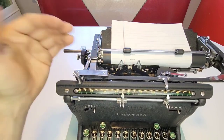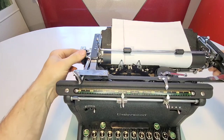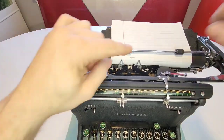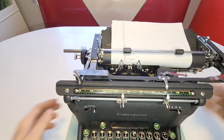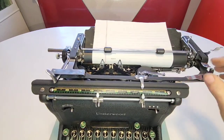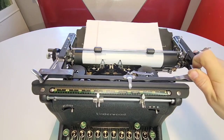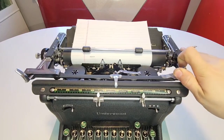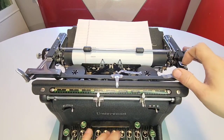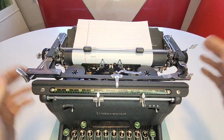If that spacing isn't what you want, there's a clutch on the side — pull it out and the platen is now free to move. So if you're doing a form that has different boxes, you can slide it around. You can actually do this one-handed, which is amazing. Push your thumb here, hold this down, and put your middle finger here — you can now go up and down and control left and right movement freely. A lot of typewriter artists use this kind of gesture and then use their left hand to do all the typing for the art. It's a really cool little system.